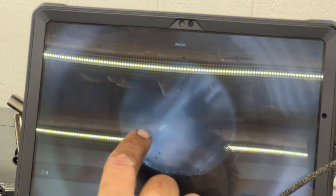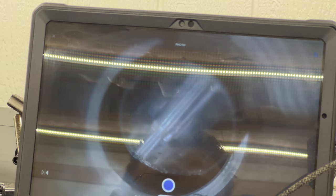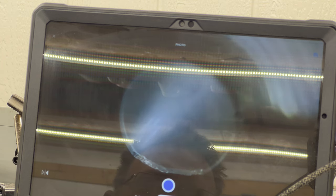Here's the visual chamber inspection through the borescope. You can see where all the lands are — they all start at exactly the same place, just as we measured. Going back through the lead, the neck, the throat, the neck, into the case taper, and all the way out. It turned out wonderful.